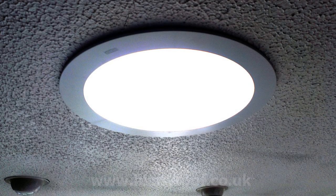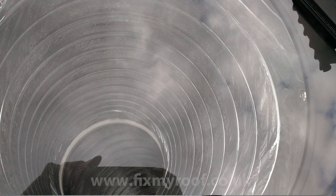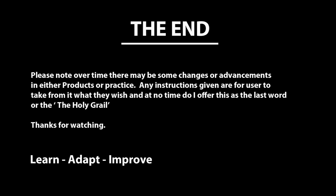Now fit the plastic diffuser into the ceiling ring and twist and lock into place. Next, slip on the decorative ring and it's complete. If you were to go outside and look down the sun tube it should now look like this. We've turned this into this — here are fitted two flexible sun tubes using the exact same method just shown. To see a short film on sun tubes before and after conversions of both solid and flexible, click on the link provided — it also comes with the best guesses as to achievable light levels. That brings another project to an end; I hope this video has helped in some way and thanks for watching.